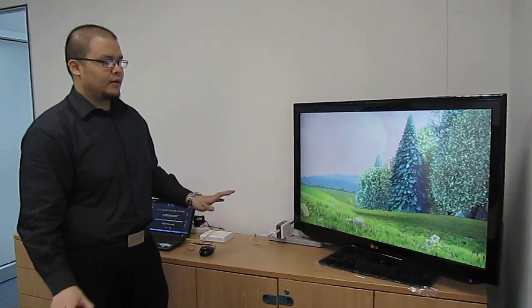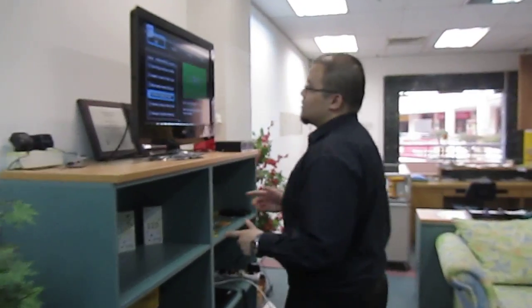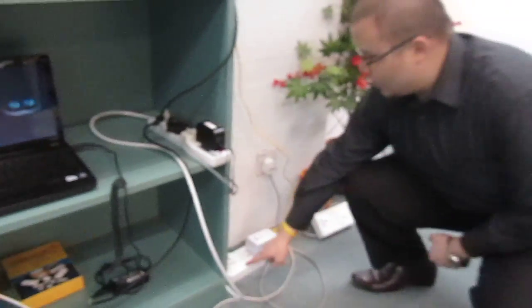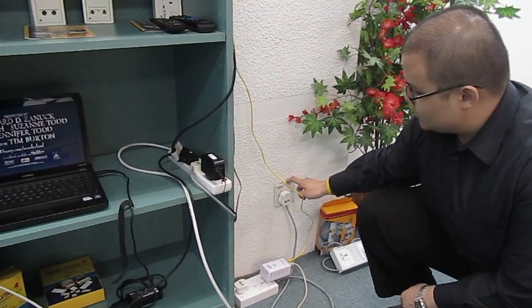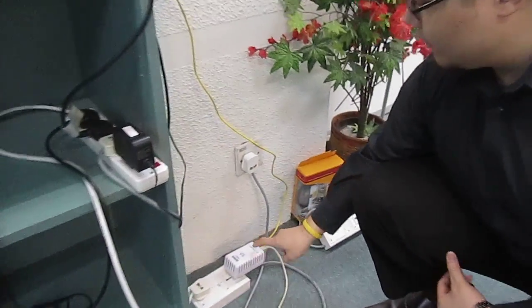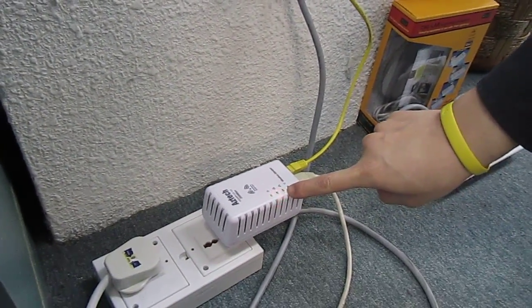We'll leave this station and see how the other stations are faring without Shure Streamer. Moving to the media station — this is the same media station as in the introduction, the only difference is we've added a laptop. Again, we're using a power bar and a two-way power bar because we are limited to a single wall outlet. The Shure Streamer has already been removed. The PLC adapter had to draw from the same wall outlet as its interconnected equipment. If you zoom in, you can see the PLC adapter LED light is actually showing amber, again indicating that the connection rate is subpar and unstable.